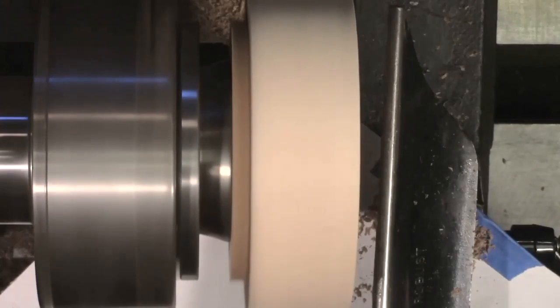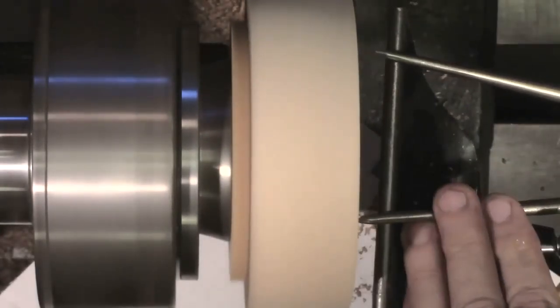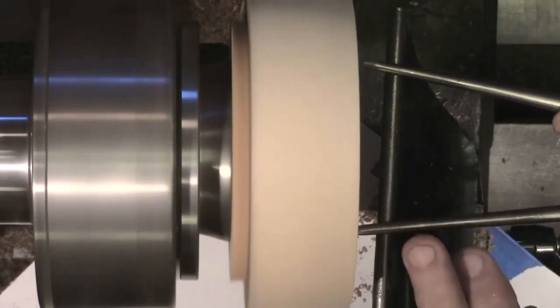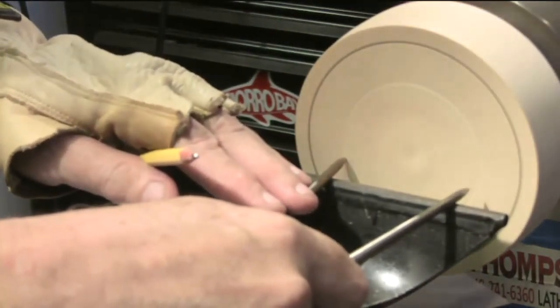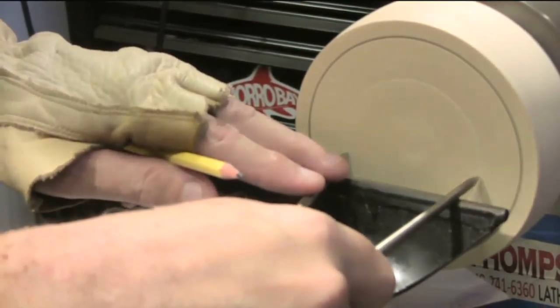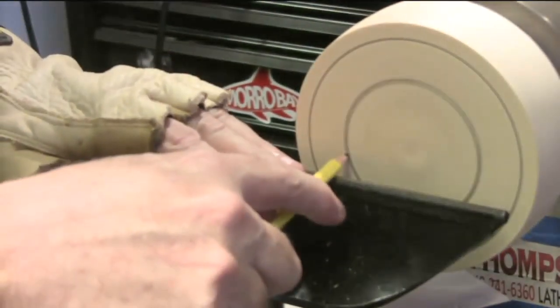I've already marked the rim size of the lid I need, so I still need to take some of that down. I've got the size of my chuck jaws marked out. I'm going to reverse this - right now this is going to be the bottom - then reverse it into my jaws to create the top. Using calipers, slowly working my way out until this point matches. I'm putting this corner into the wood but not the other corner, otherwise it's going to come back and bite you. I'll mark that with a pencil so I can see it.